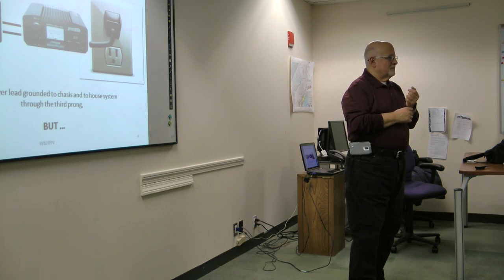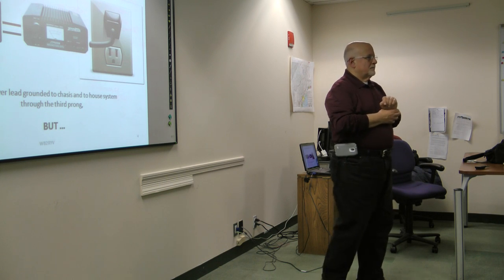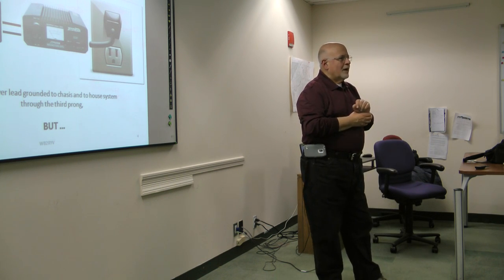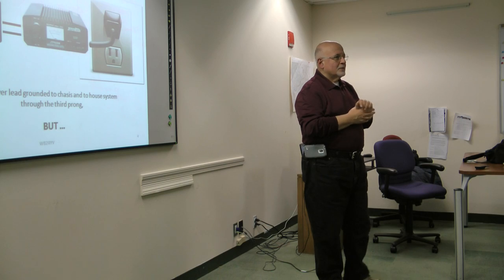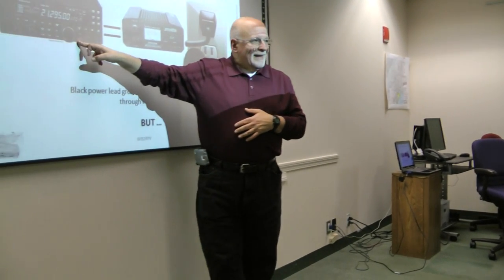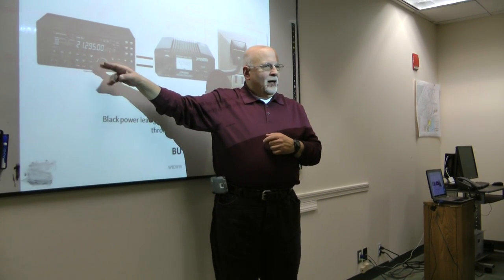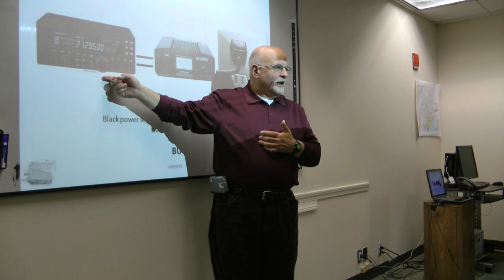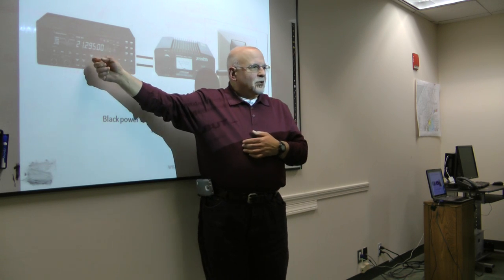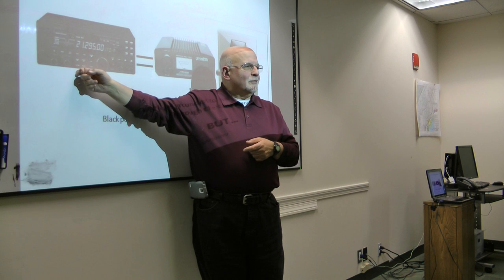Well, I would think this is correct, but I've read this about Astron power supplies, and I suspect there are others as well that may be isolated. Okay. So you've got to do it on a case-by-case basis. So watch out for the isolated power supply. What that means is that thing doesn't have an AC ground. Now you say, yeah, but I only got 12 volts going into there, so big deal. But there are spots in a typical 100-watt transceiver where you've got 1,000 volts.